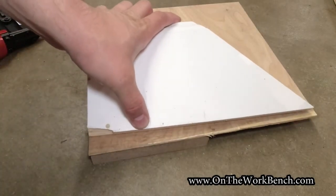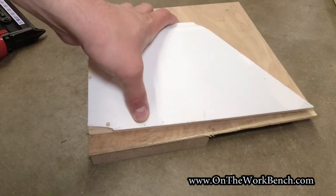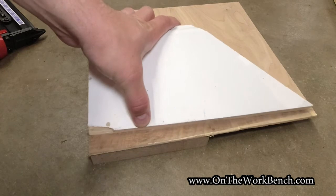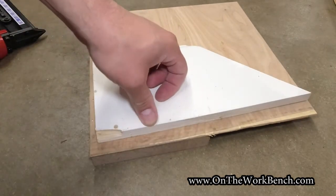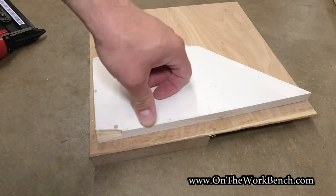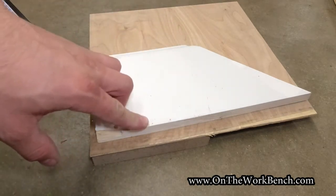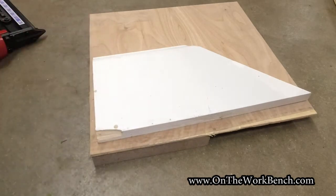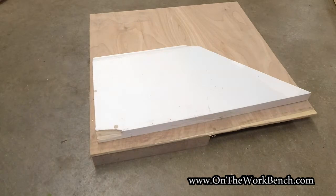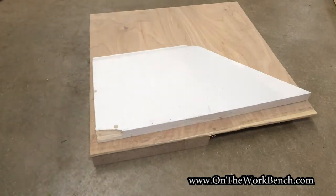And so it's definitely leaving a hole you need to be able to come back and touch up in something that needs to be finished. In my case, I think this will be perfect because I'm going to be nailing from behind and it'll hide just well because of that 10 millimeter depth being short enough, but clearly something to be aware of with that firing pin driving down. Maybe I could back off the pressure on this just a little bit further to refine it, but it looks like those 10 millimeter 3/8 nails do look fine.